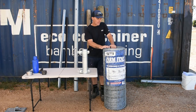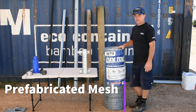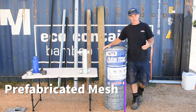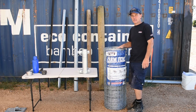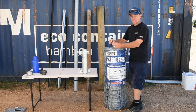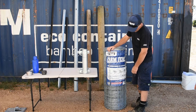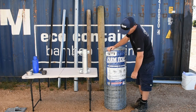Now we're going to talk about pre-packed panel wire. There are a million different brands out there and different products. This is a Southern Wire product, ironically called Farm Fence — not a bad product, I actually quite like using it and have used it on quite a few jobs. It's relatively expensive compared to some brands. This is great for sheep, horses, cattle — it's more of an all-purpose alternative. I like it because the rings are tightly looped, as opposed to some that are a bit loose. This is our 790-30 configuration: 7 vertical runs, 900 millimeter height, with 30 centimeters between each vertical.